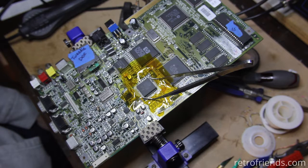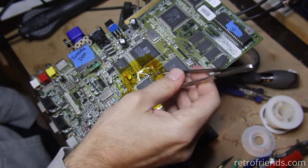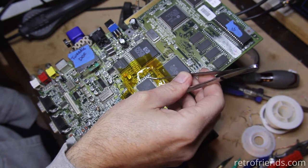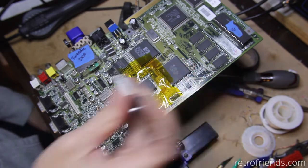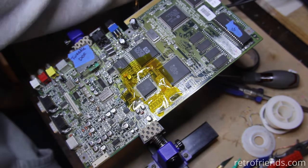The second thing is you do want to have something that will give you some prying ability. You have to be very careful not to pry too hard, because you will rip the pads right off the board. The weight of these tweezers is just about right — not pulling up too hard. But once all the solder has gone molten, it should just pop out. There is one drawback to doing it this way in this demonstration — we'll cover that a little later.